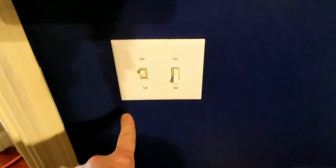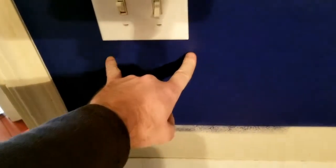I've got to get my nail gun. I need to find where the studs are next. So that's my next thing, is figure out where studs are. There's a light switch. I know there's a stud either here or here. So wherever this stud is, we'll probably be 16 inches on center the rest of the way until we get to the corner. Then I'll have to do it all over again until I get to that corner.